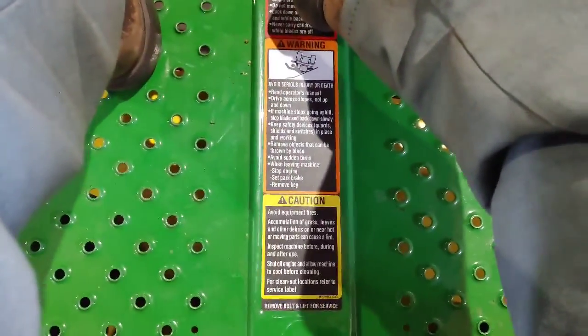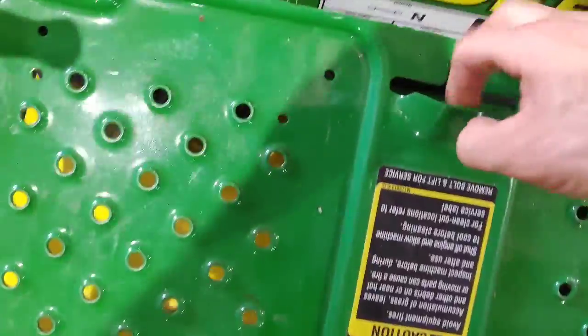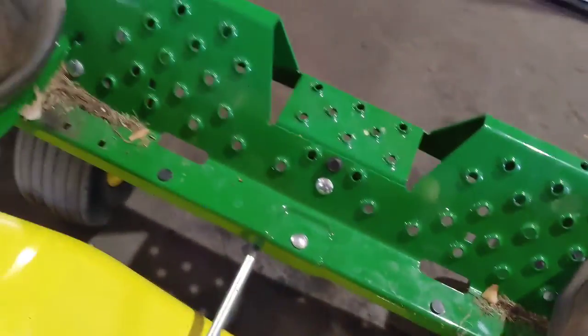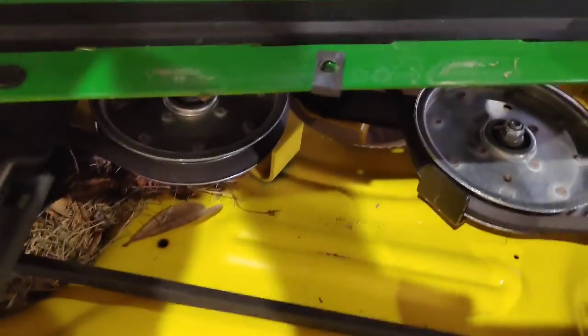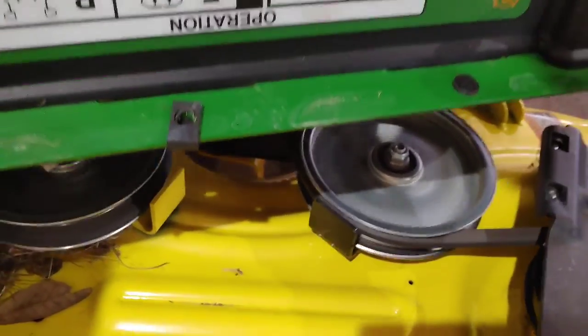So right now I can hear something's wrong — either a spindle or idler. I'm going to take this foot plate off of here. It takes a 13 millimeter, or you can use the little wrench that comes with it for the deck height adjustment. I'm going to hop back on here and get a better idea of this sound. When you're running the blades, you should overwhelmingly hear just the blades swishing in the air when all the spindles and idlers are good. I'm going to crank it back up and let you guys see the belt and how everything's running. It's definitely making some noise — there's either an idler or something.